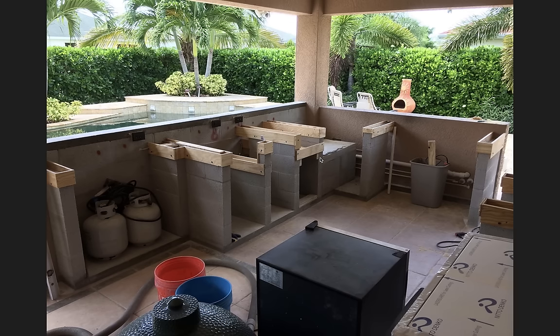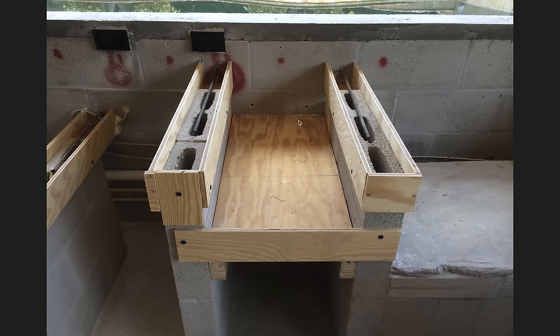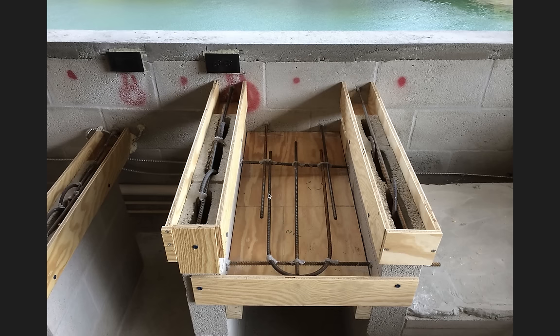Here's the forms around the fridge, and I started to form the area where the side burner goes. Here's everything capped, ready for concrete. Here's the finishing up of this area with some rebar. You might think this is overkill, which it for sure is, but this is like 80 to 100 pounds of concrete and I did not want it collapsing under its own weight — that's why all of this rebar is in here to give it one complete structure. Weber wants one inch of air on the sides and the bottom all the way around in order for this side burner to work properly, and if you just follow their instructions it pays off. Nothing flammable can be within 24 inches of this side burner.